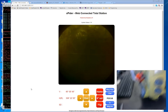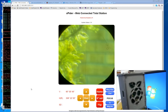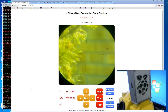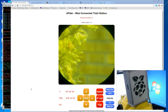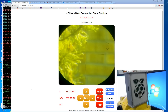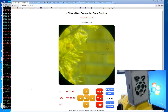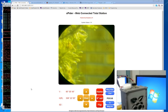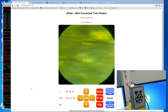Connected to the total station is a Raspberry Pi computer inside a 3D-printed case. Inside is a Raspberry Pi version 1 Model B — a little older but still a great pocket computer running at 800 MHz with 512 MB of RAM, about a quarter of which is dedicated to video. There's a Wi-Fi dongle attached to the USB, which makes this total station completely cable-less.